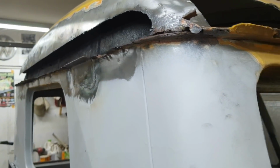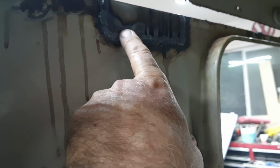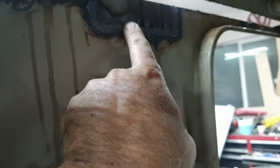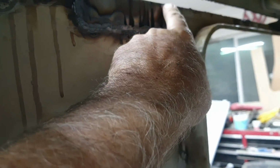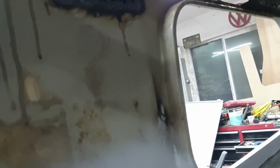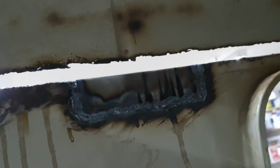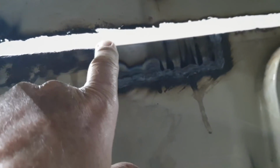Just like I said, a little bit of hammer work usually is the case, and you still got to do filler. Now, if you did your work right, you're going to see almost what looks like a weld on the other side. So that's good penetration. It's all the way through. I don't see any voids in it. No daylight areas. It's just maybe in the very corner.